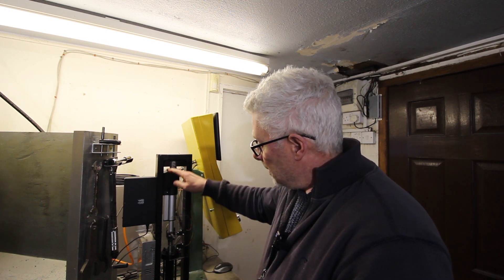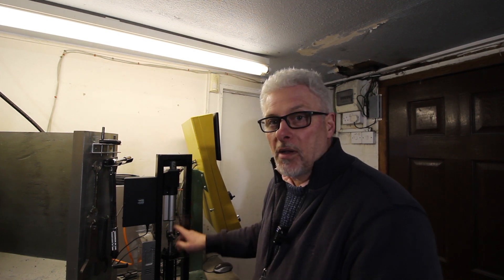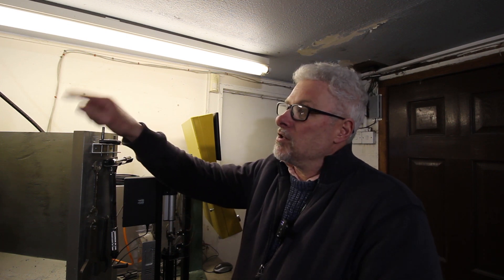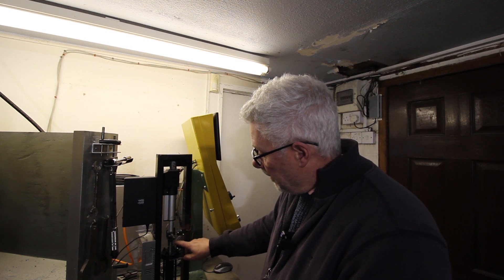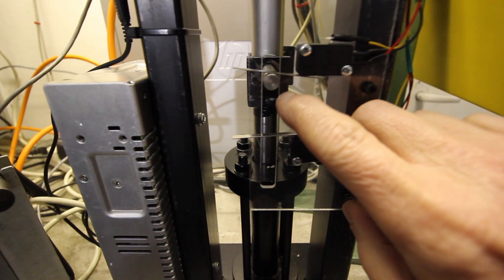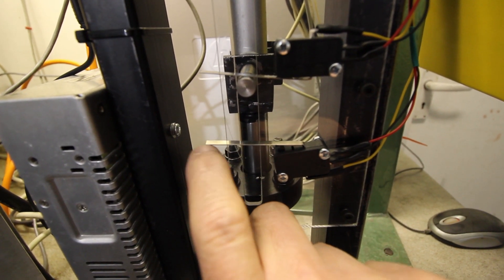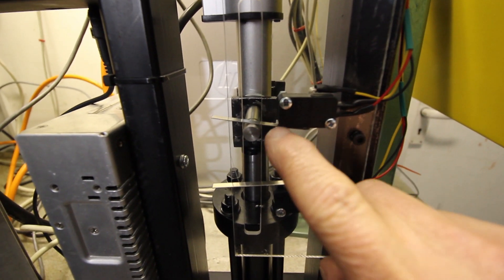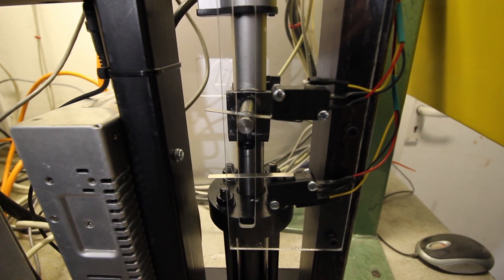Well, after what seems like a lifetime, we've finally got the blasted thing back together again. The actuator is reassembled with its new gear. That's put back. And I've made some changes to how the limit switches work — effectively we only need to drive the power cylinder for about four or five millimeters, that's more than enough. So I've reduced the amount of travel by reducing the amount of travel on the drive cylinder. I'll show you a close-up of that. There we have micro switches that have long tabs to operate them — quite useful for this sort of thing because you can bend the tabs to move the actuating point to where you would like it. Hopefully this should work.